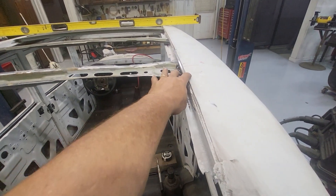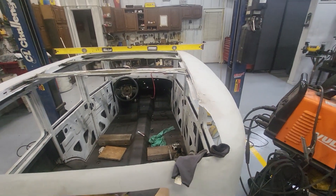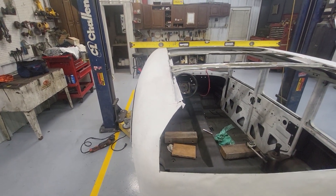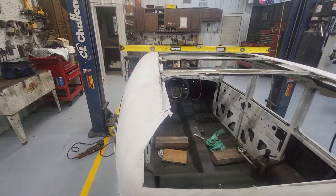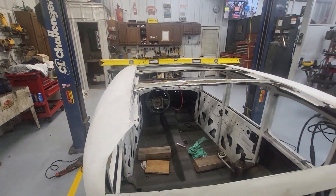So it's right on that surface, so when I come in to braze it I'm just grinding this down and any amount of filler is minimized — hopefully just the primer surfacer. It's a lot of area to weld but that is the plan. Now I'm going to come in and start cleaning some of this up so that I can weld in that last brace as far back as possible in this curve.